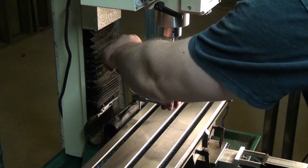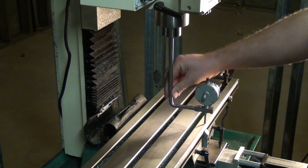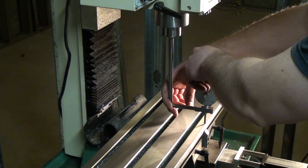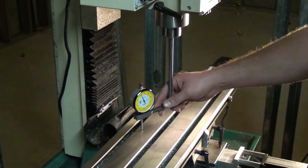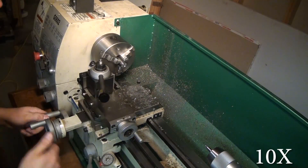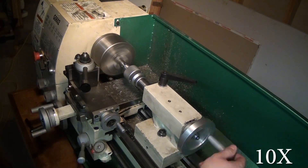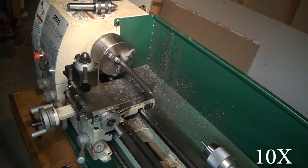You can see here the finished indicator holder. The bend looks pretty crappy and as you'll see when I do the machining, the rest of it looks really, really terrible, but it's actually quite functional and I found out that my mill was out of tram by about twenty thousandths. That's because I've recently moved to a new house and I'm setting up shop in my basement. I'm going to have twice the square footage that I had in my garage, plus heating and air conditioning, but the lighting right now is terrible. I apologize for how crappy this footage turned out.